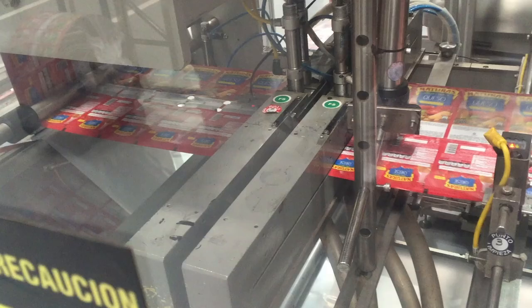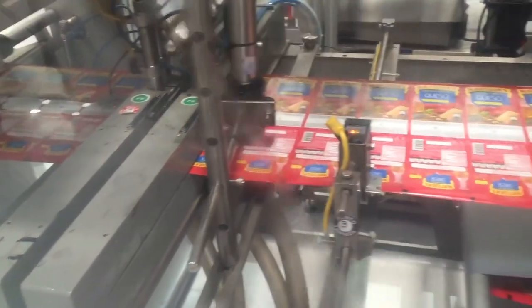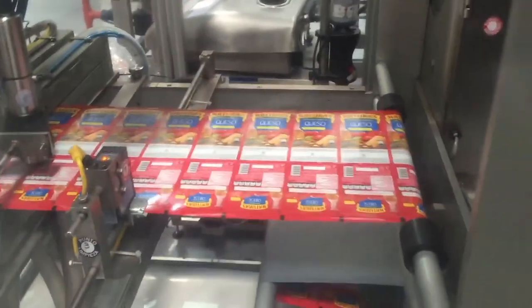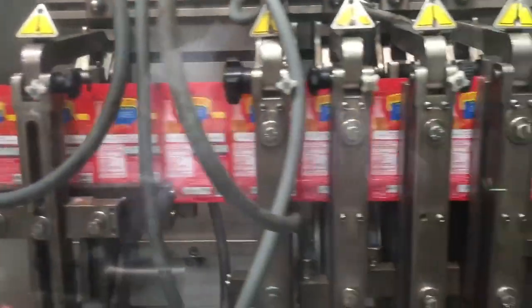This video shows Branson components actually installed in a fully automated assembly line for pouches. This high-speed pouch fill station takes the material off of the roll, orients it, and ultimately produces a pair of pouches filled simultaneously with a cheese spread. You will see two ultrasonic 20 kilohertz welders positioned horizontally side by side. And although you won't see them moving in an actuation, the anvil that is hidden is moving, compressing the pouch against the horn.